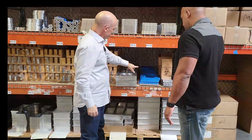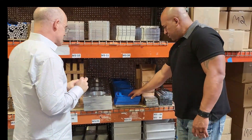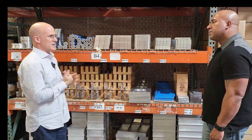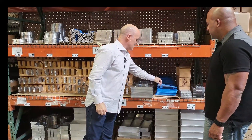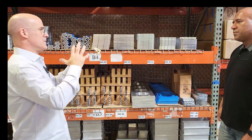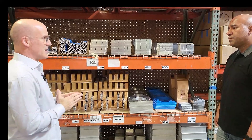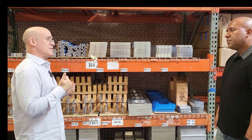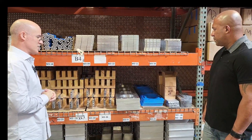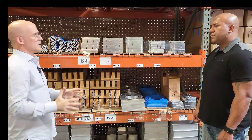This is another interesting part that people don't see. This will damp the speakers — these layers of EAR material are designed especially for us. When we actually build the speakers, we can measure the vibration on the panels and see which frequencies need to be addressed. Based on that, these elastic materials are built for us and pressed between the plates to create constrained layer damping. For anyone who thinks aluminum is not a good material for loudspeakers — think again. It's extremely stiff and light for its stiffness, it doesn't store energy, and it's extremely easy to dissipate energy from it. You end up with a very well-damped structure, yet extremely stiff — the perfect platform for a loudspeaker enclosure.